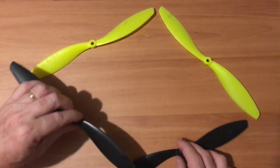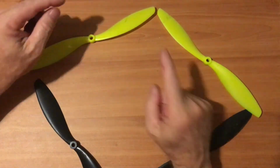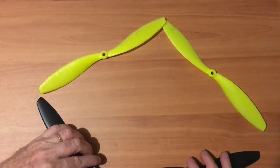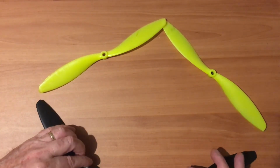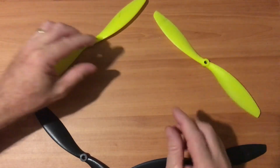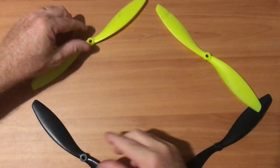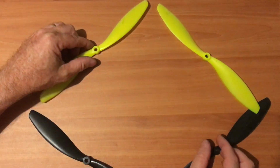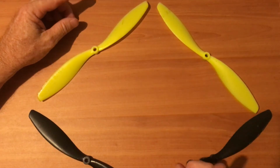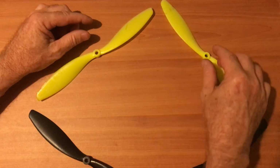And as you probably realise, there's my quad rotor, that's the front. If I want to pitch forward, I command that on my controller, and the back two motors will throttle up, pitching it forward. If I want to pitch back, same. If I want to roll left, the two right hand motors will throttle up. If I want to roll right, the two left hand motors. The question is, if I want to yaw, how does the system accommodate that? Stop the video now so you can have a think, because this is the whole beauty of Newton's third law.